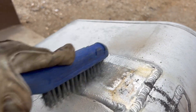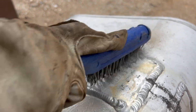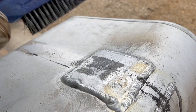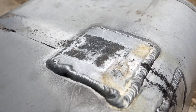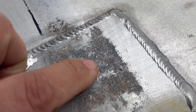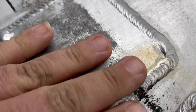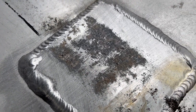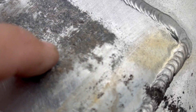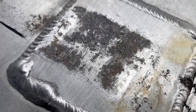This is my buddy Russell showing me how to clean aluminum correctly with a stainless steel brush. I'm going to show you how I do it differently and why it works better for me. The issue is that with a brush, the debris gets stuck in the valleys and you can't reach them because the brush just scoots over the top. Same thing with a flat disc - the material stays embedded, and even changing directions from all four sides it's never going to come out.